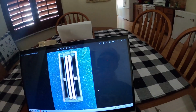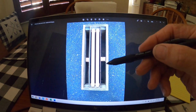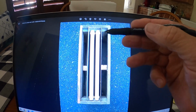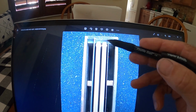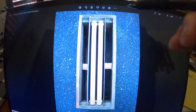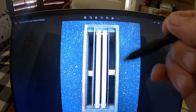is a Steve-O five-frame Beefy beehive. And what he's done, he's taken a Beefy beehive. So you've got, right here, the inch and a half material on the ends with pallet wood sides. What an economical box that is. And what he's done is take some 1/8 inch tempered masonite, and see what he's done. He's cut in here to center line, so he's got a slot. So you cut these ends before you assemble, obviously. And now we've taken a five frame Beefy with an internal two frame nuke.